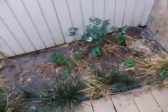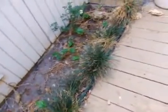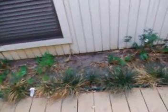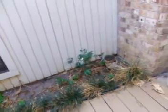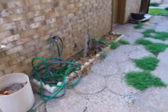Now, the culprit is here. Got this plastic edging, which is sealing the water in and not allowing it to drain. What you want to have is drainage of that water out into the rest of the yard, away from here. As it is at the moment, it's trapped in this area, and this will give a water hot spot. In other words, water concentrates here, and it causes the ground to expand more here than it does at another point, and that causes differential movement in the structure.